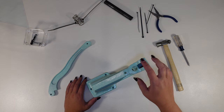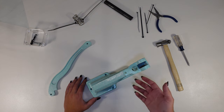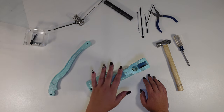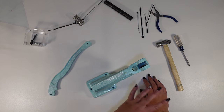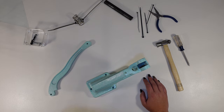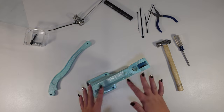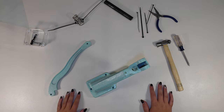It's not a huge problem where this press assembles — you don't want all of these small holes absolutely coated and gummed up with spray. A small overspray is not a big deal — you'll be able to push through that when you put the screws back in. But if they're totally gummed up with paint — and we were doing really light coats over and over, so we shouldn't have that problem if we're painting properly — but if you get the holes really gummed up, you're going to have a hard time and have to chip some of that out. I didn't tape things off like that because these holes are big enough it shouldn't be a big problem, but just a little additional tip there for you.